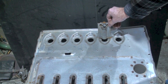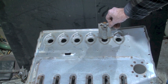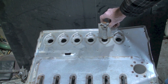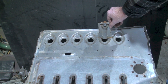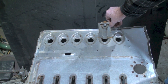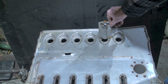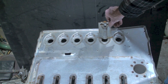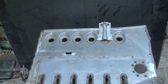Normally you'll have a set of burners — called in-shot burners — that shoot the fire into the primary heat exchangers. There are two heat exchangers: primary and secondary. As the flame goes in, the heat exchanger starts to pull the heat off the hot gases. Once the gases are pretty well burned, that's the heat exchanger's job.